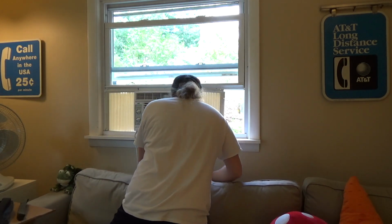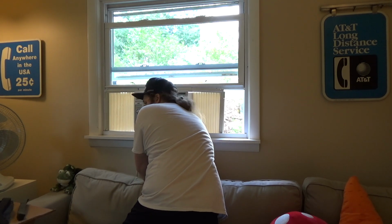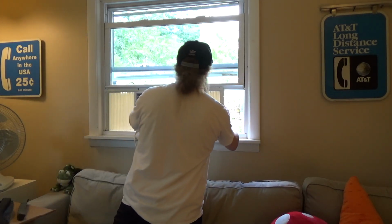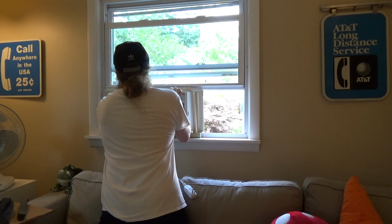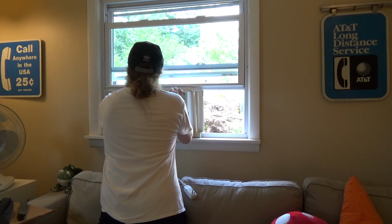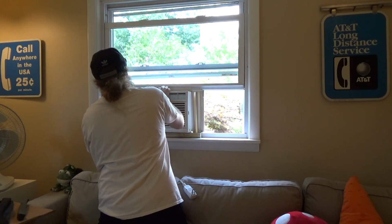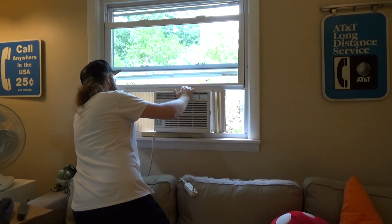It's actually designed exceptionally well. It comes out at the top. Yeah, that's how they all should be. And it has 8-way adjustment, which is kind of nice. Would you believe a lot of people were complaining in their reviews that it comes out the top? What's wrong with that? That's how it should be. It's actually better because cold air sinks, so you want to blow it up and then it sinks down so the entire volume of the room is cool. Right. I would also imagine that the temperature regulation is probably a little bit better because the unit's less likely to recirculate the air coming out of the register over the thermostat. Yeah, I'm trying to recall if I ever even used the thermostat. I think I always just turned it down all the way for dehumidification purposes.